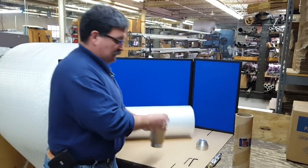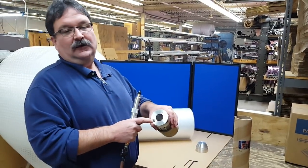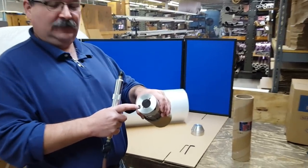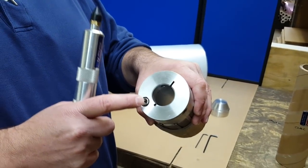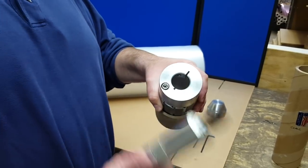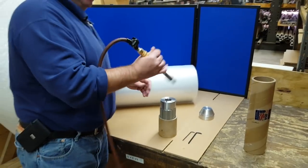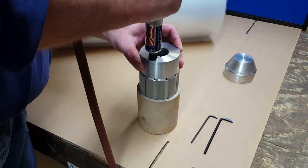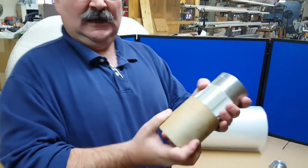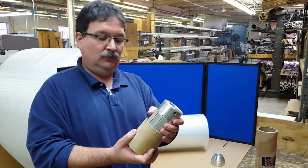You would take CAC's inflating gun, which has a rubber tip. This is called our PTV valve. CAC's CoreLock air chucks are available with other types of valves — this is the more common type, but we can also do a Schrader-type valve. You take CAC's inflating gun — it's just a push gun, so you push the rubber tip onto the valve, and when you do that, it inflates the chuck. Now the chuck is locked inside of the cardboard core.